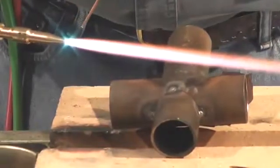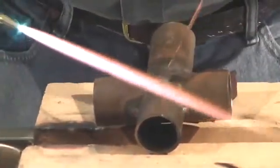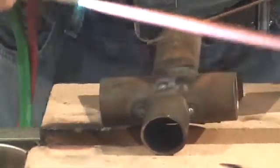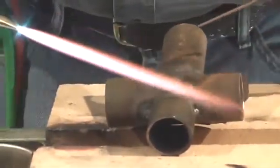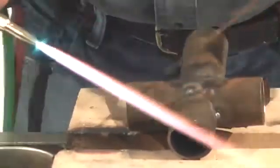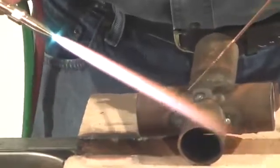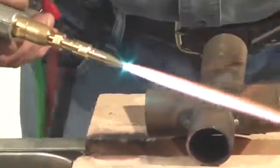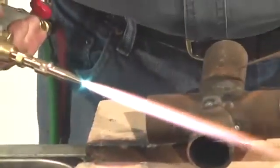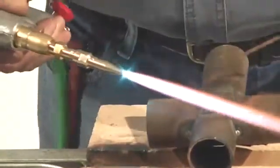With the number one tip, I'm running that flame out a little bit. I'm using a 3/32 steel rod. A lot of chrome moly rods you can get at your welding supply house — they have different numbers from different companies, they all work great. If you're doing .063 wall versus this one-eighth inch, about 125 wall thickness — if you go down to .063 or less you don't need much preheating at all.